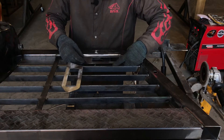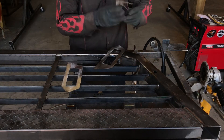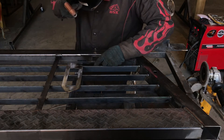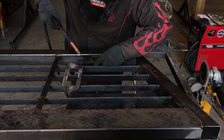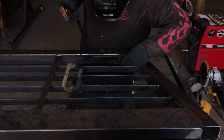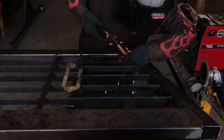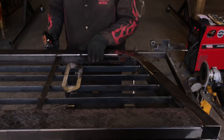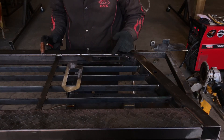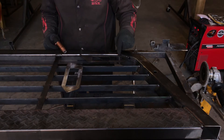Just make sure all of it's at the edge of your radius — a little plus or minus is up to you. Get my welding helmet on. As you can see, I got my three tacks. What I usually do is weld this section here all the way solid, and then just do a short stitch weld here and a short stitch weld here. There's no need to weld all the way across — it's just a waste of wire. So I'm going to solid weld this and then do a couple stitch welds.